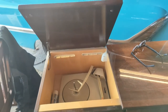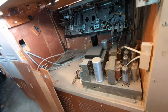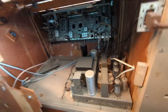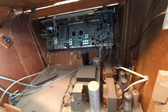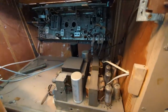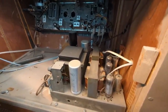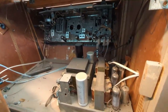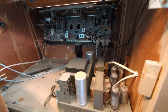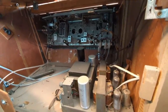Here is the back removed. Unlike other models I've worked on of this type, the power and amplifier chassis and the tuner are together in the same space, which is nice — usually the bigger model has that unit down at the bottom and it's hard to get at. One of the first things I noticed is that all of the output tubes have RCAs, which are obviously American tubes, so those are not original. The previous owner may have put in a fresh matching set.